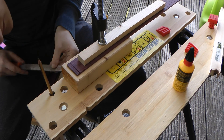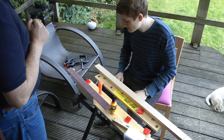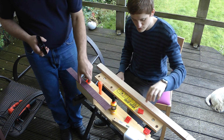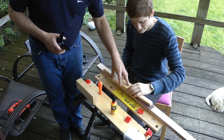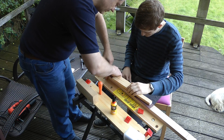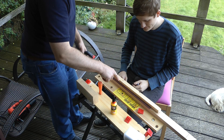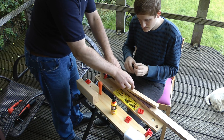It's getting there. Before we do any gluing we should work out how we're going to clamp. The idea is to put two of these on the ends and the G-clamp in the middle. Well, we can do it like that and put the G-clamp across the two in the middle and then spread it over more.